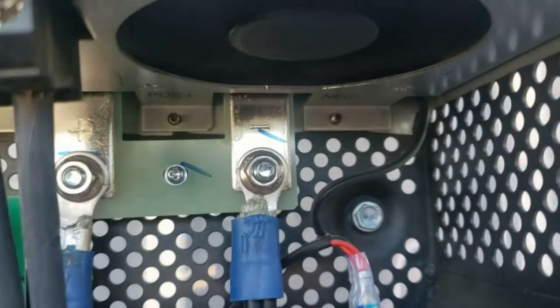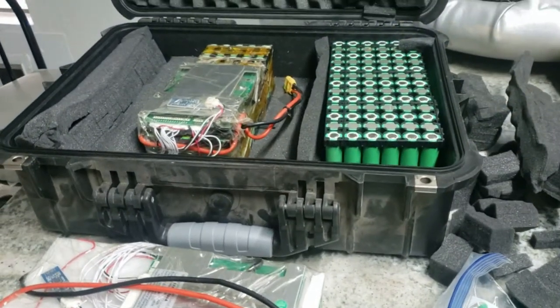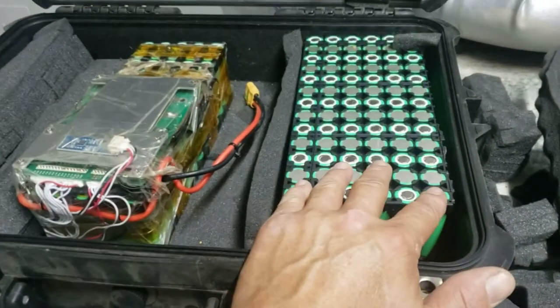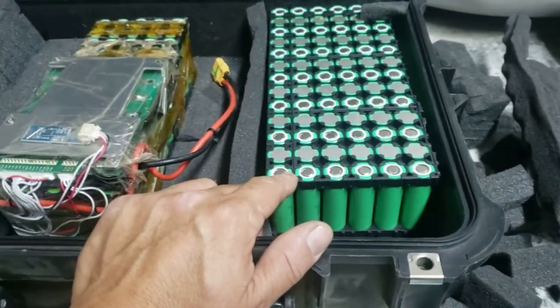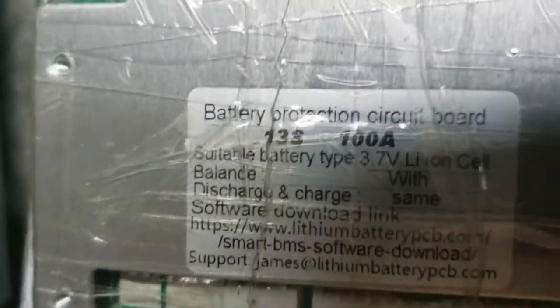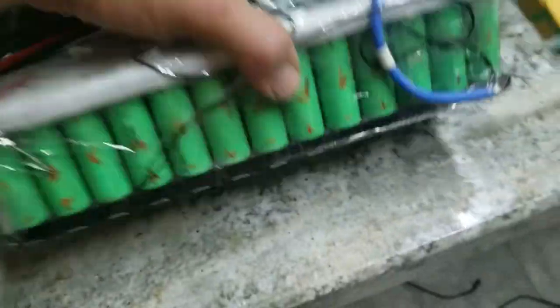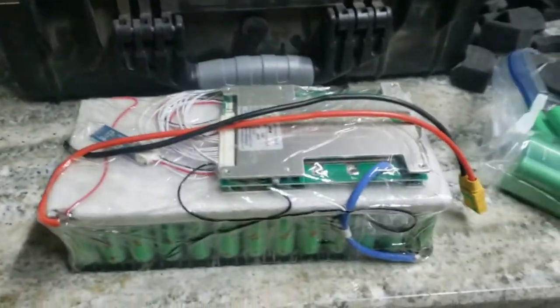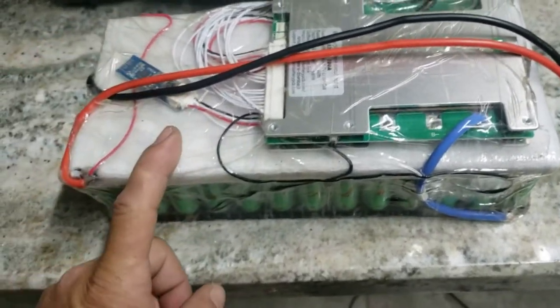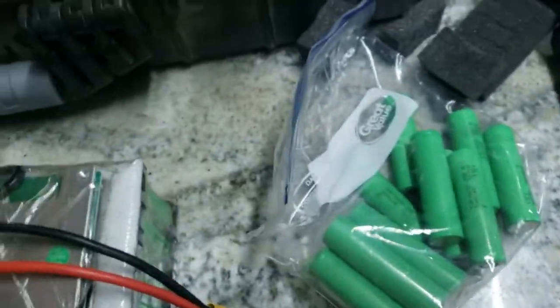It also has four battery inputs, which I will eventually connect. I made my own home batteries that I will be using. This is a 13-cell BMS — that's a 13-cell, 700-amp BMS. This is the battery. I'm going to change these cables to 8-gauge. I used these for my electric bike and they work fantastic. I'm going to be powering more out of these when the solar turns off, and these will back up the battery. I'm going to add another roll right there to the batteries.